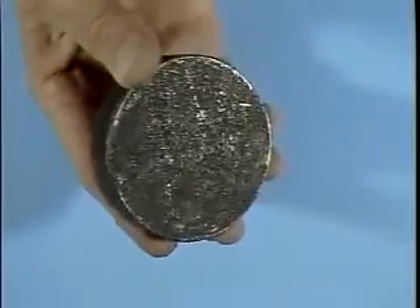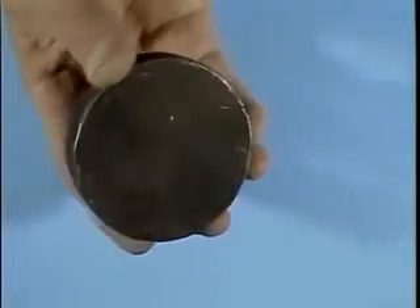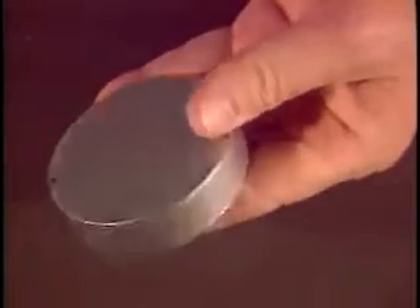The jackpad should be made of 2-inch to 3-inch diameter steel bar stock cut to a thickness of a half inch. Round the edges, sandblast, and prime with Philly-Clad 1000 if required.